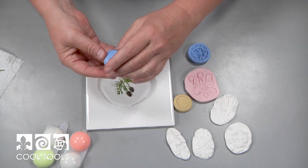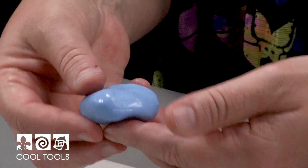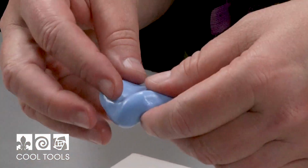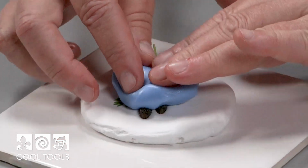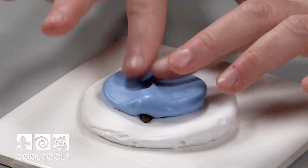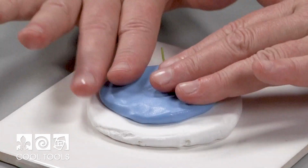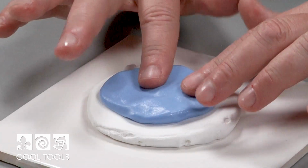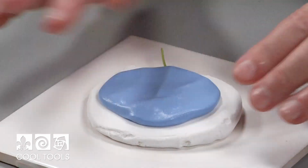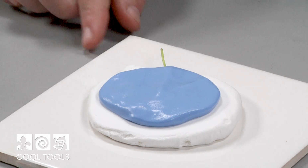Now what I usually do is I just kind of make it into a ball again so I can get rid of cracks and creases and stuff so that doesn't become part of my mold. And I'm going to lay it down on the surface and push. Some people take their material and put it on the top, but see, there's gravity. And gravity will just make that thing you're trying to mold sink down in, sometimes uneven. You get kind of a weird little double image. So I always like to go on the top down. That way, gravity can fill in the gaps.